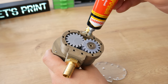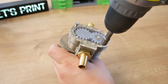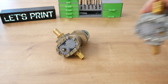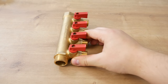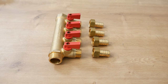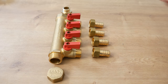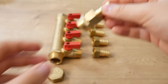Between the water pump body and lid I use a bit of rubber glue to seal it better, and after that I secure the lid to the pump with M4 bolts. Now we need to build an outlet. I am using a brass fitting where I can connect 4 hose nozzles. For one side I had to use a stop nut, and to the other side I need an adapter that converts 3/8 inch threads to 1/2 inch. And there goes another hose nozzle.